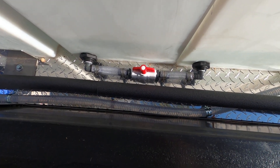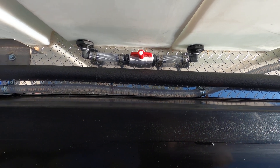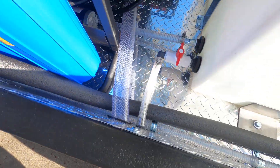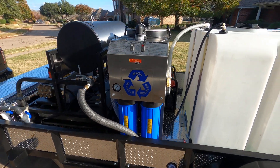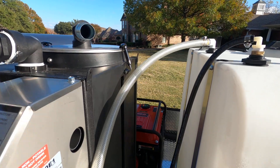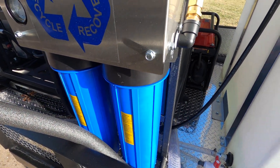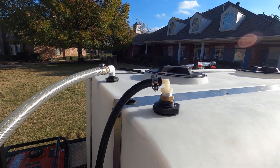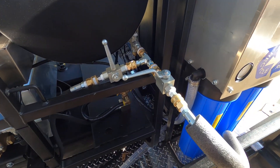There's some trick plumbing going on here to separate or put the tanks together depending on what mode you're running. Here's our pump out for the reclaim system — great, very powerful system. It'll suck up the water, capture it in this tank, then pump it through the filters back into this tank. That's our cold water bypass right there for the pressure washer.